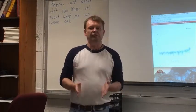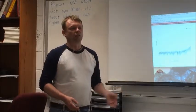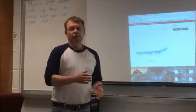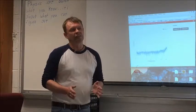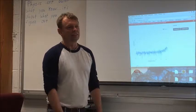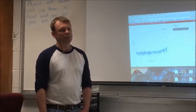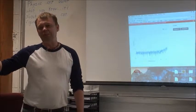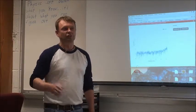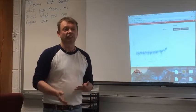Another situation is that you have a very stable generator, one frequency, again a signal splitter, your amplifier, and an antenna matched so you don't have any reflection, and you rely on the stability and cleanness of the signal. Everything is matched, everything works perfectly, but you see that you get junk in the signal. What is going on? Well, you discovered that you pointed the antenna at a window, and you happen to have a transmitter outside. So the antenna works both ways. It transmits and receives. You transmit your signal, but you receive the signal from the transmitter outside. This signal gets to the amplifier, to your device, and adds to the signal from the generator, and you get junk.